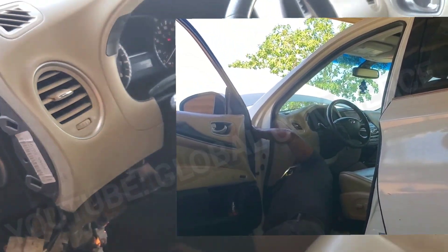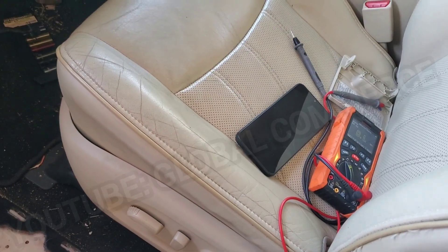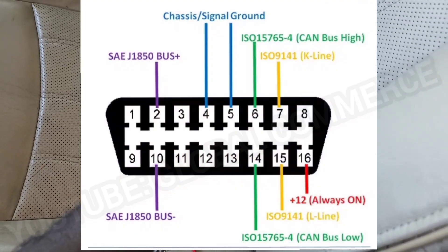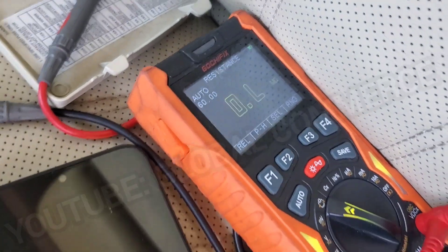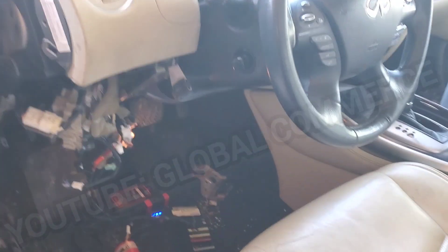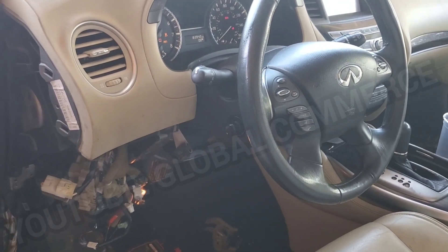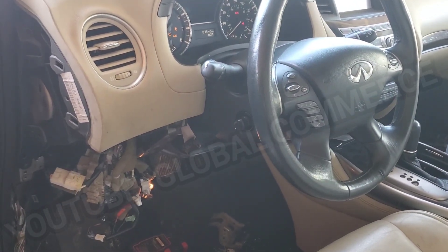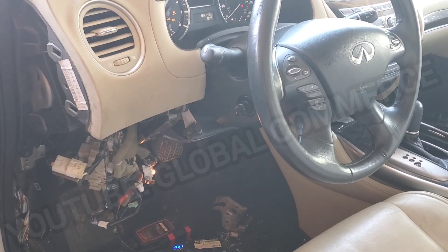For this job, the first thing I did was put a multimeter — since I had no communication — and you're going to want to go between pin 6 and pin 14 with your multimeter in the ohm setting. I was reading right at 60 ohms, which tells me everything on the network was communicating from end to end where the resistors are, which means mostly all devices should be on the network.